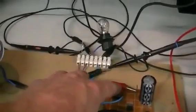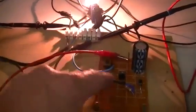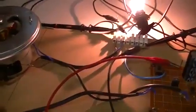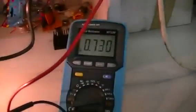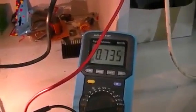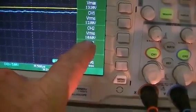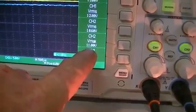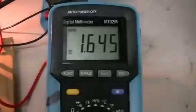So now we're going to switch the globe on. You will hear the motor bog down. This switch does the globe and also brings our shielding circuit into play. We've got about 10.6 volts, but it is very different with the load on it — and we'll leave that for another video. So now our motor is drawing 736 milliamps, still at our rated voltage, and just across our globe we can see we have about 10.6V — 11V max — so 10.6V RMS because it's got a slight ripple in it. And the current is 1.645 amps. So I can turn the globe off and you can watch what happens.